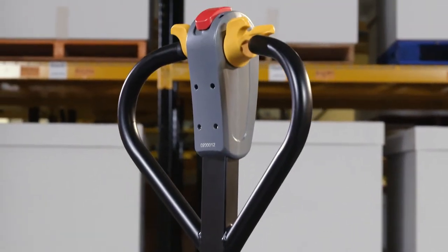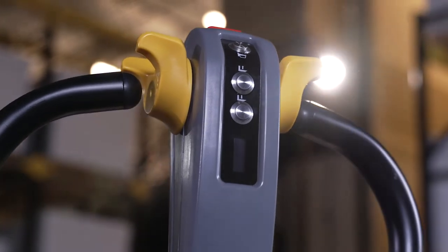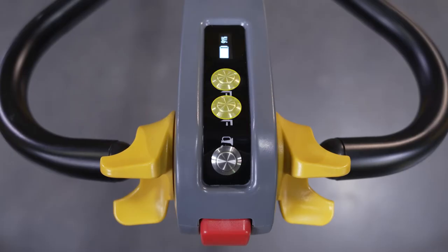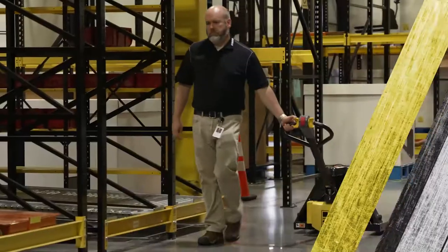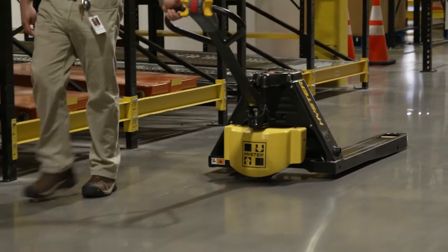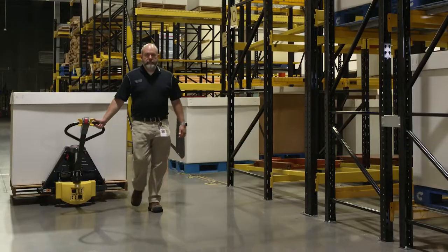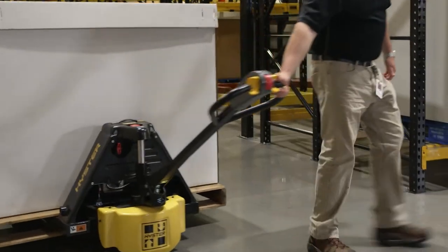The pedestrian electric pallet truck is equipped with an ergonomically designed handle assembly that controls directional speed, lift lower, horn, reversing switch, and includes a long handle that helps reduce steering effort. When walking, control the truck with one hand, using the steer handle. Operate the truck with forks trailing whenever possible. Handle loads only within capacity and load center shown on the nameplate.